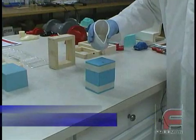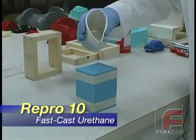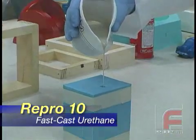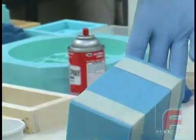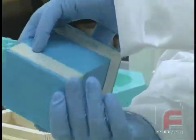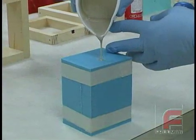This is our Repro10 tan, which has been agitated, weighed, and mixed. Because of its low viscosity, Repro10 pours very well. To make sure that we have no air bubbles on the surface of the mold, which might naturally occur around the headlights or other detailed parts of the model, we pour in a little material and then rotate the mold to make sure the entire surface is covered first, and then we finish filling the mold.